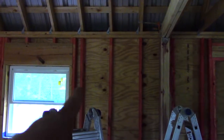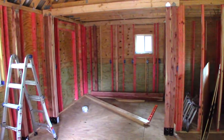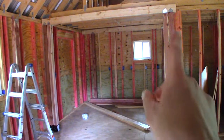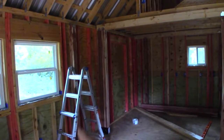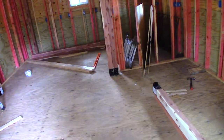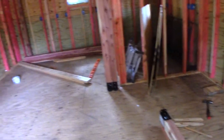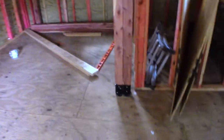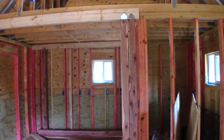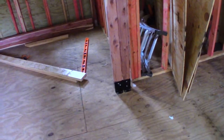Now I'm going to work on another set that goes right about here. This is what I got done today: I got this frame up with these two posts and these two posts. I got the beginning of the next frame — this post right here. I spent time prepping up the next post, but I didn't want to put those up there because the other post that goes with it is not prepared yet, and I didn't want anything to come out crooked. These are two 4x4 red cedar posts bolted to the floor by these metal frames.